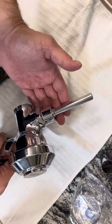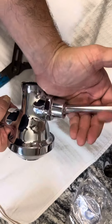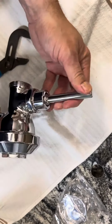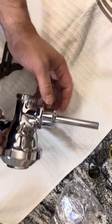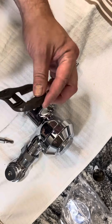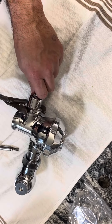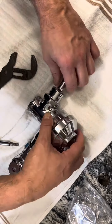So if we have a bad handle for our flush, you can get it where as you pull these down, they tend to get loose or leak right here. We would want smooth-jawed channel locks or an adjustable wrench to be able to take that off.